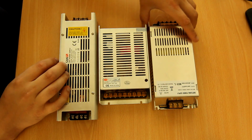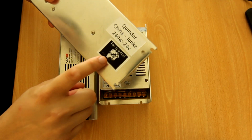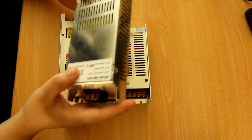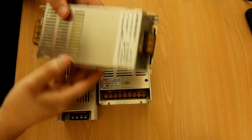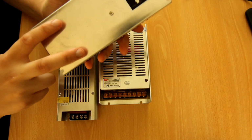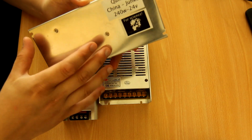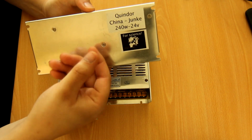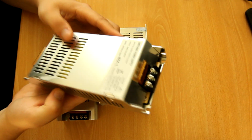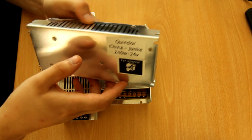For instance, this power supply, he doesn't mind if I break them. So that's why there are 4 science stickers on there. This one is in a very thin aluminum housing. There just isn't that much power dissipation going on. The switches are here on the back. These screws don't just hold down the board, they actually hold down MOSFETs and a diode on the other side. But it is relatively thin. There are no corrugations. There's no real good way to dissipate the heat.